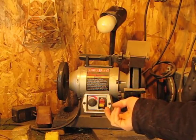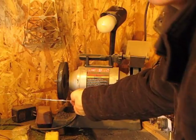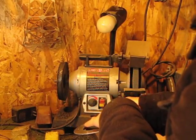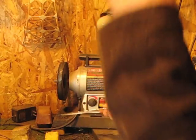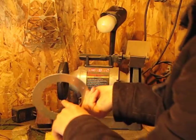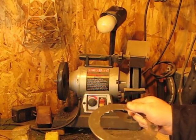What we're going to do is take the aluminum and hold it against the wheel like this. I suppose you can kind of see it. Pretty much I'm trying to catch the outer edge. You never want to catch the inner edge, because with a buffer wheel, if you're buffing something and it was catching on this edge, most likely what it's going to do is catch this and throw it up against the wall. So you want to be careful about that.